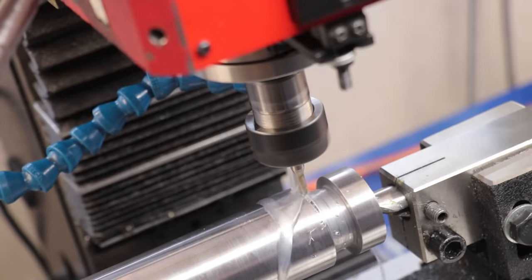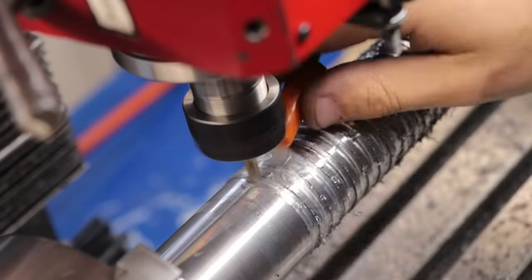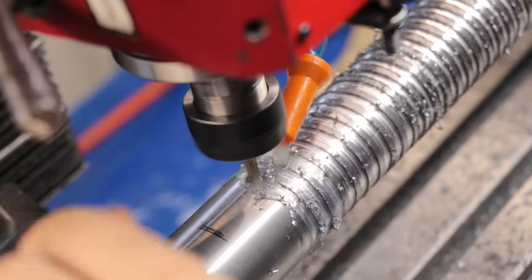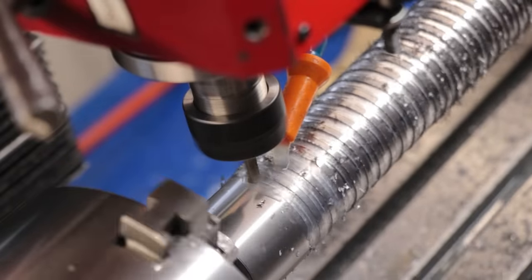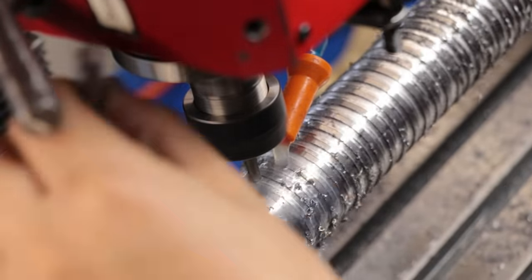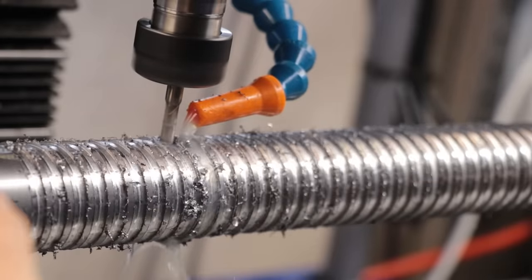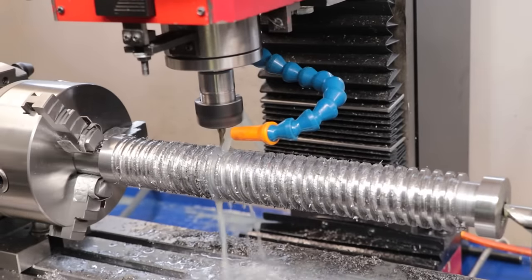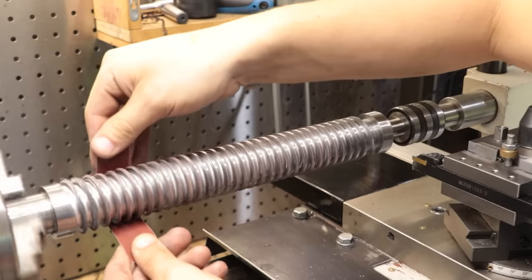Now helical milling, like I've said in the past, is not a particularly fast method of producing screws but it does work. All it is is gearing the lead screw to the dividing head to make the dividing head move with the table. It does put a lot of load on the cutters and I did break quite a few cutters doing this. So I tend to take it as slow as possible and keep the cutters cool using as much coolant as I can. You do have to be pretty careful that the part doesn't slip in the chuck, which it did once on me. And once you commit to doing a cut, you have to follow it to the very end. The setup always leaves really bad burrs, so a bit of sanding and filing does remove them.